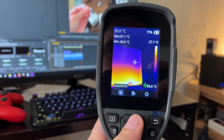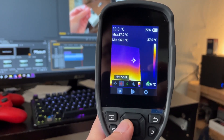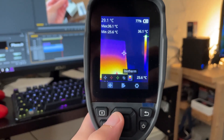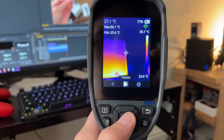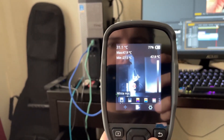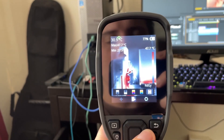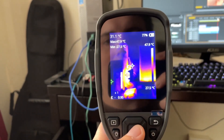Tapping this brings up measurement options. You can turn on high, medium, and low spot. You can also change the isotherm setting. And there's the palette — you can have white hot, black hot, iron (which has been the default for decades), rainbow, and red-gray. To be honest, iron is good. In the settings you have measure parameter, which covers emissivity and such. Emissivity is how much infrared light something emits — something black will emit a lot, something silvery won't emit nearly as much.